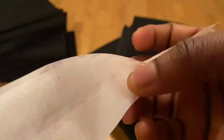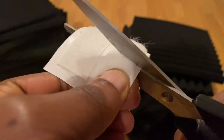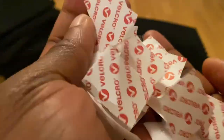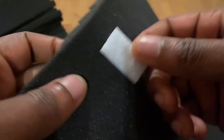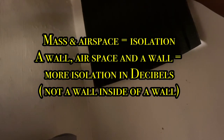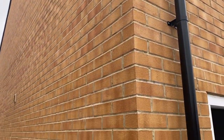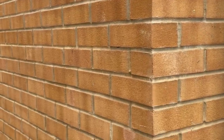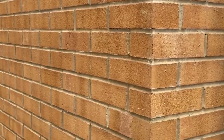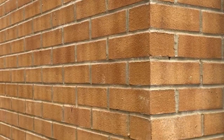To stick acoustic foam on the wall, use command velcro 3M stickers — peel off the adhesive covering, stick it onto the back of the acoustic foam, then stick it onto the wall. Mind that sometimes paint may peel off when removing the acoustic foam, but command strips considerably reduce that effect. Lastly, isolation means mass and airspace: if you've got a wall, an airspace, and another wall, you'd have better isolation, but achieving that involves a lot of construction and is quite expensive. Utilise the acoustic treatment techniques highlighted previously and you should be able to improve the isolation capabilities of your studio. Don't forget to subscribe, like, and share — it helps the channel grow. Hopefully catch up with you later. Goodbye.